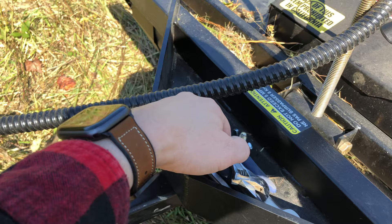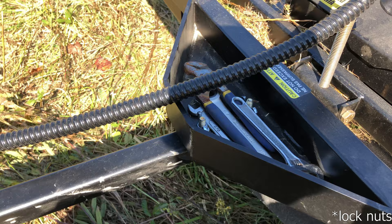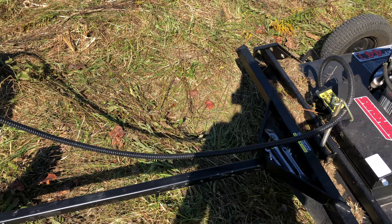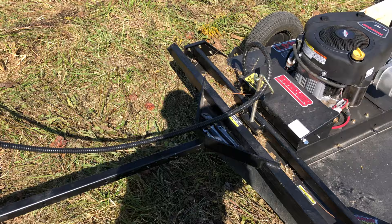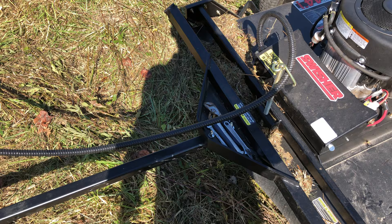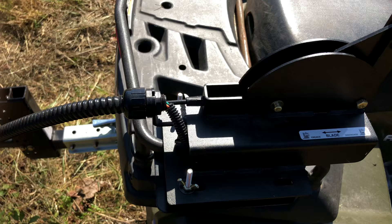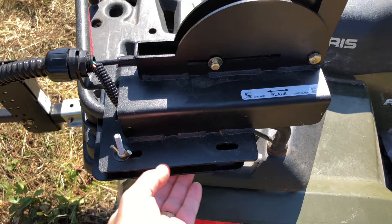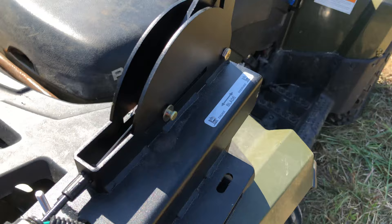What I have to do when I move it is I actually have to completely disassemble this bar — take it off of this part here — which is why I have butterfly nuts to connect the bolts from up top here. It just makes it easier. What they provide with the package are lock washers, and those will just wear out eventually. The key thing to remember is that this thing vibrates like crazy as you're going through, so after an hour you want to make sure you stop the machine and tighten up everything. One of these butterfly nuts actually got loose on me yesterday and ended up stripping out a little bit of the threads from vibrating around, so now I have to replace that bolt. Same thing over here — the controller which engages the mower — one of these bolts just vibrated out yesterday.